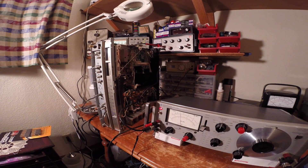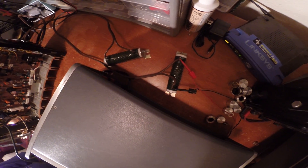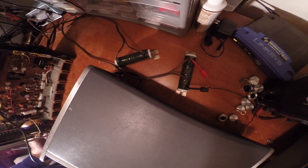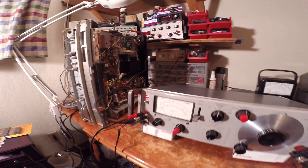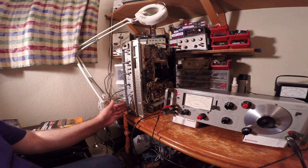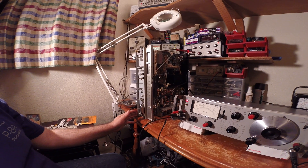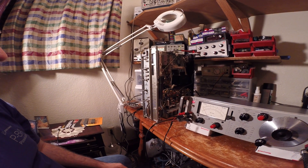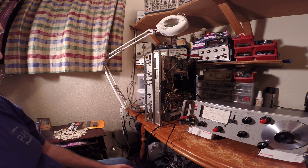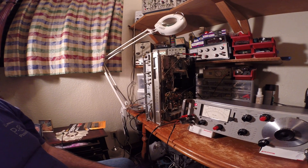So this amplifier is well within specifications. Go ahead and show the load resistors in the back of this thing — there are two big green things. Those load resistors right now you could probably cook an egg on, because they've been driven pretty hard. But there you have it. The point of this is that the amplifier is operating well within specifications of 0.08% distortion. In fact, that was a conservative number — it's got better distortion specifications. And it's old, and it still has very good distortion characteristics. So that'll be the end of that video.